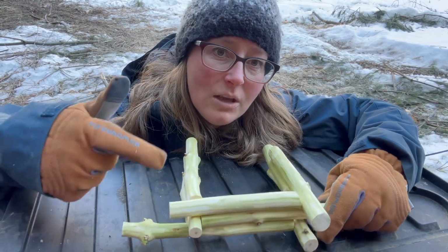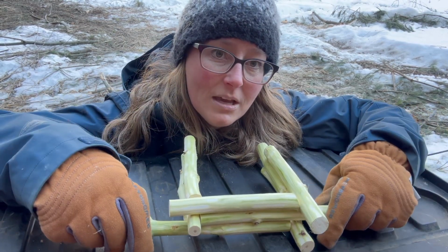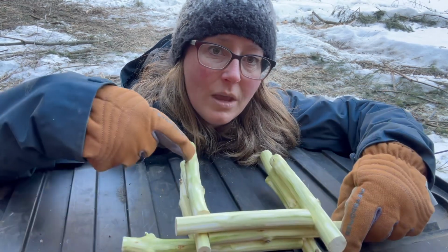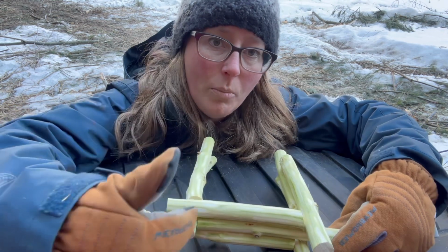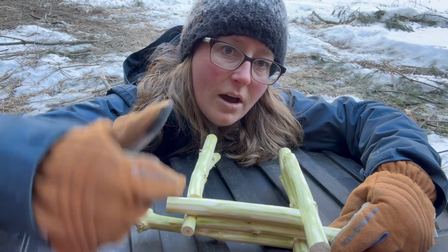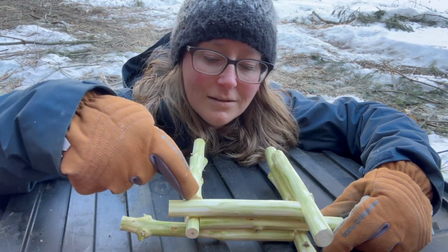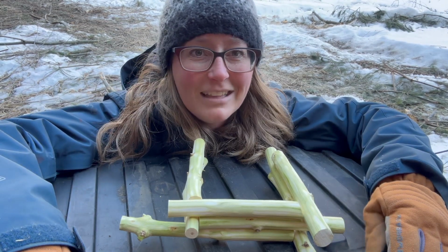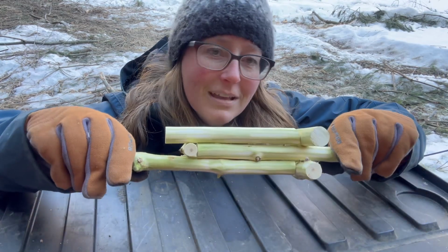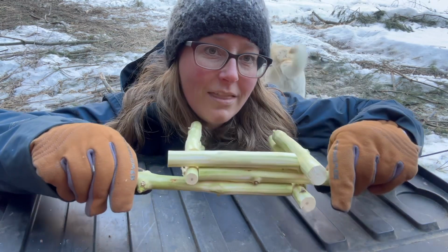And then every single place in the house where 2 logs touch is going to be connected with rebar. So even on the ends here, so we have a butt right here, we'll put a piece of rebar in this way, so it goes through this log and into this butt end, I think like 12 inches or something like that. I don't remember. But that is the very basic explanation of how this goes together.